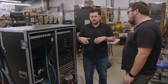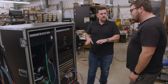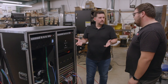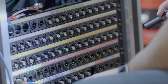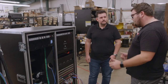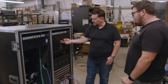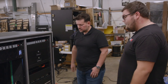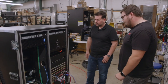Let's talk about MADI real quick. One cool thing about the Ultrix is the audio mapping — it's great, something we haven't had before. Routing typically will bring in signals and if it's got embedded audio you can deal with that. But this actually takes all the MADI signals and you can take all that audio and embed it wherever you want — take a signal and grab some of those channels and just embed whatever, wherever. In this case it's 64 in, 64 out. So however you need to do it, it's there. That's an incredible amount of flexibility. And of course everything here — some utility drawers — we've made really good use of just the space that we have here. It's all about efficiency.